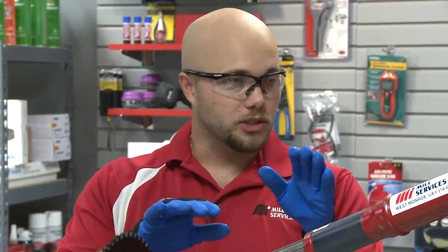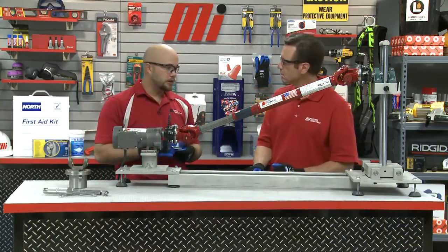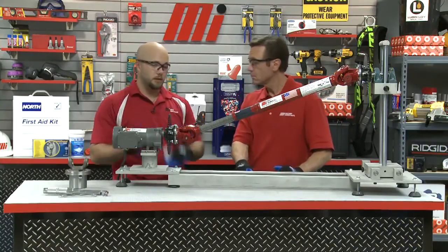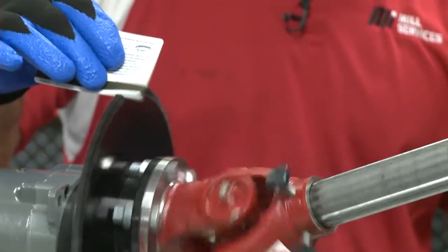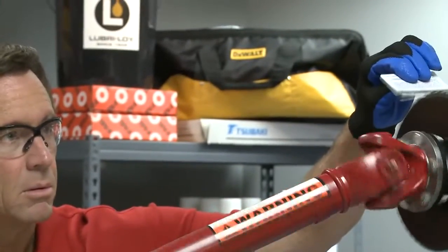Basically we're going to look here, and I'm going to use this demonstrator to show how aligned flange yokes makes everything work as it's properly designed to. First run, I'm going to turn it on, and I'm going to use this card and actually listen to the frequency it makes on these sprockets. I'm going to test the drive side — it's going to be a constant speed from the electric motor. Everything's good. Now you try your side. It sounds like a constant noise on both sides. Yeah, it's constant speed. Everything's running great.